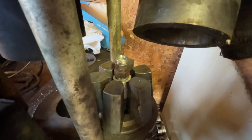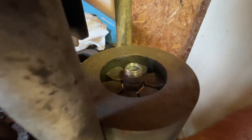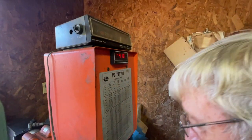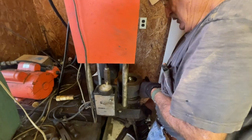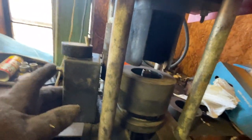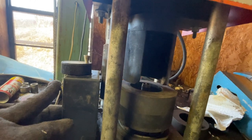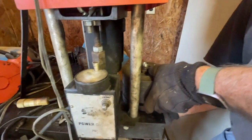What you do is you put it in your dies, then you drop this on top — this is what pushes down on it. But you also have to pull it down enough so that when you crimp it, it'll move and you don't go past it. You've got your setting right, everything's ready. When you press this button, you hold it down until it stops — you mash it until the machine itself stops, and it stops under pressure at that reading. And that's it — it'll automatically release.